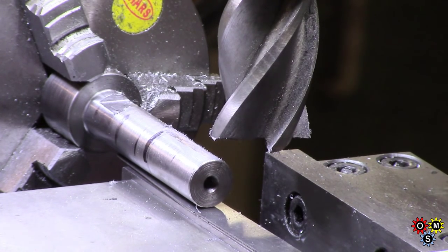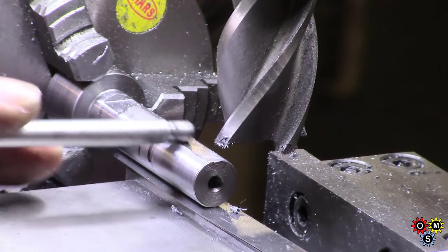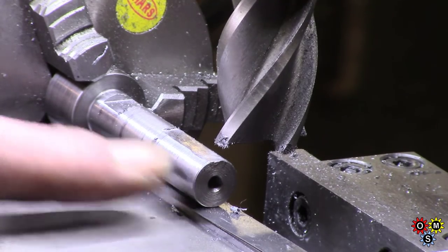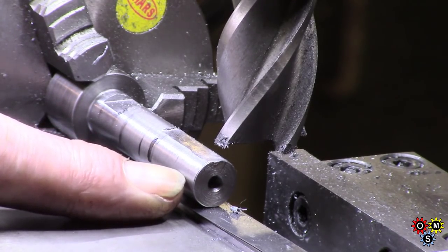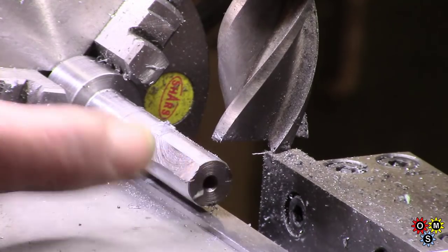This is another worn cutter — it's the only inch I've got, desperately needs regrinding. I have to take very small cuts. I took the other down to 50 thou, but here I think 20 thou on each facet should do. I stopped that at 15 thou taking small cuts — that's the only way to do it with an old cutter. Also the stick-out here is a bit excessive. I'd like to have used a hex collet block, but because of the shape of this it wasn't really going to work. That cutter was doing more punishing of the metal than cutting.